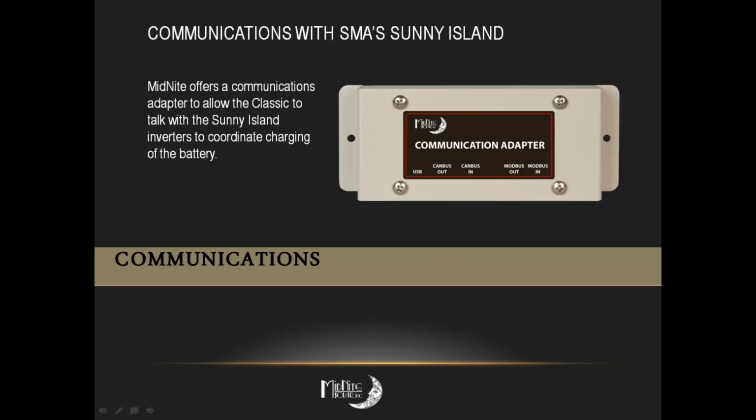We also offer this communication adapter for use with the SMA Sunny Island. This basically allows the SMA to control the battery charging of the Classic. So you would still set the charging set points in the Classic like you normally would, but then once this adapter is in place and you choose SMA mode in the Classic and everything is connected to the Sunny Island, the Sunny Island assumes control over the Classic, and it all works seamlessly as a complete system.